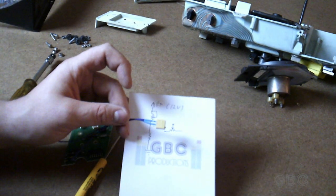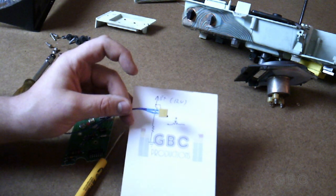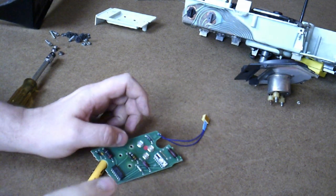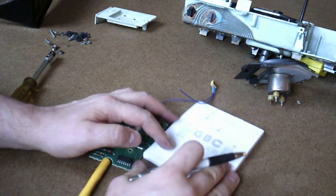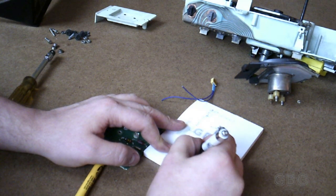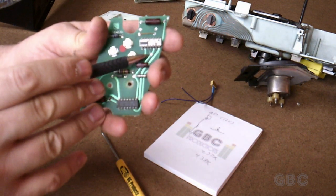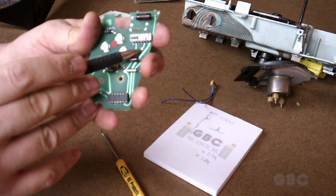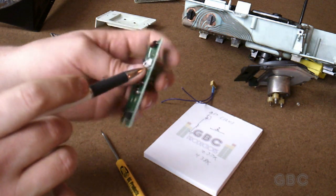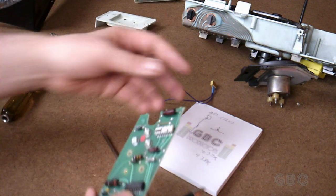The original resistor is supposed to be 257 kilohms. I'm going to cut that calibration resistor out of the circuit and measure it. It tested at 438k — that's way off. Here's how I cut it out: I cut the trace on the circuit board right here. It may look like I'm going to the wrong pin, but if you follow the traces on the back of the circuit board it does go through that pin. The other pin on this package is not hooked up to anything — they're just using it to route the wire.